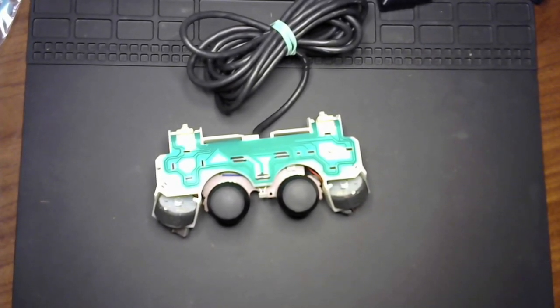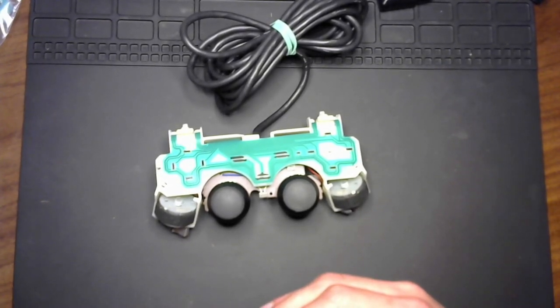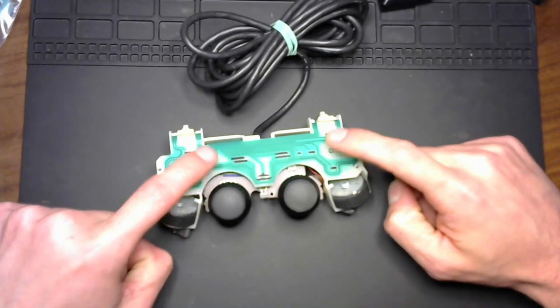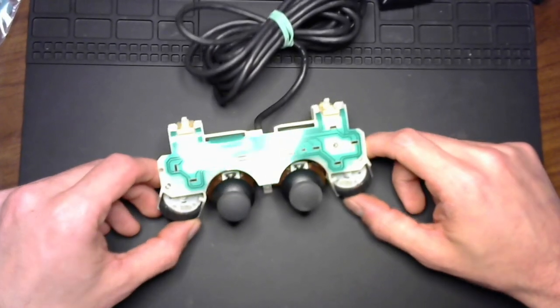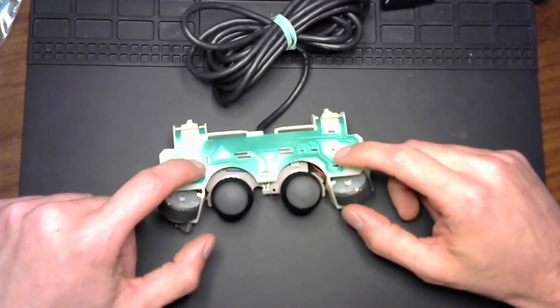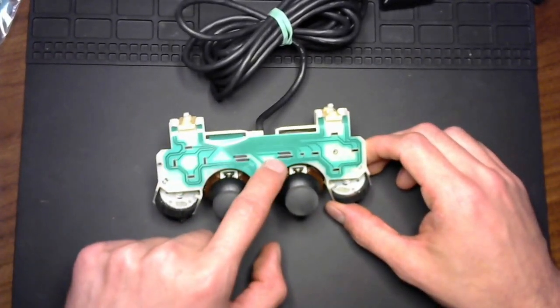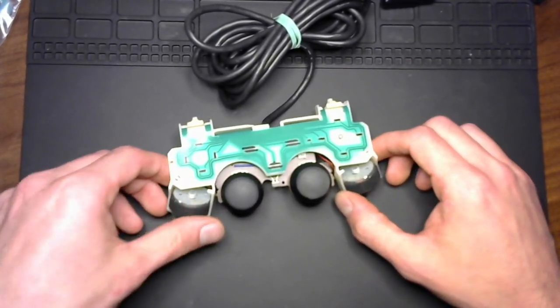In general, the H models, I'm just kind of aggregating my knowledge and reading on it, were pretty much considered to be the least reliable of the three manufacturers, in no small part due to this option that they went for, to use this flex ribbon cable to make the button connections. Something about the design here has just caused these particular controllers to age out over time. There's something in here that causes these connections to eventually break down and just stop working.